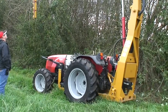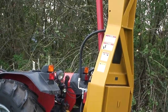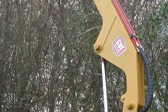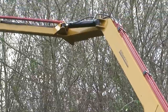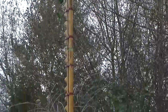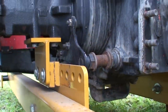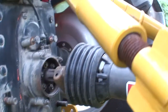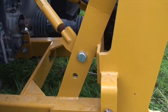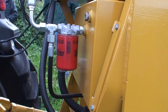We have what we call our standard cutter bar and then our Magnum cutter bar. The standard is rated at inch-and-a-half diameter material; the Magnum cutter bar handles closer to two-inch diameter material. As for mounting, you could do three-point, but this specific unit still has to bolt underneath where your loader frame would be — just to make it more rigid. You're reaching so high in the air that you want to hook to the tractor pretty well and have that counterbalance.